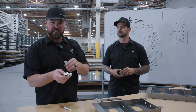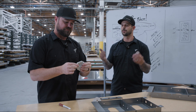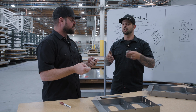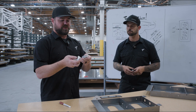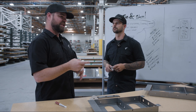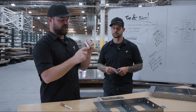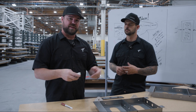That larger allowance accounts for any taper in the cut. You have two different tapers to account for: the taper on the registration of those tabs and the taper of the inside diameters — and that's doubled. You have to account for all these tolerances stacking up. It also depends on the material: half-inch mild steel has slightly less taper than half-inch aluminum. On aluminum, we get a little more striation and dross, so open it up a little more on thick aluminum than on thick mild steel.